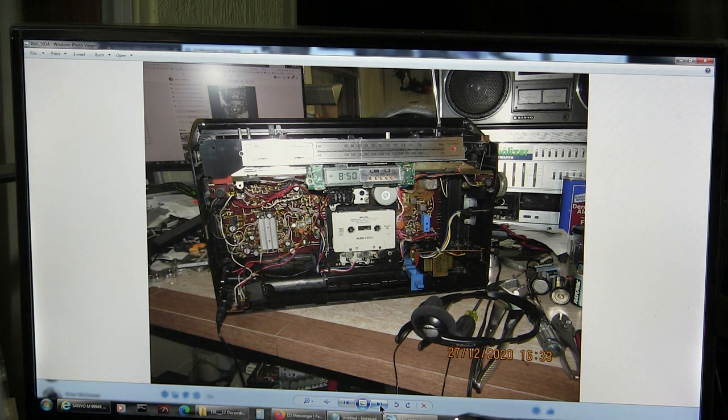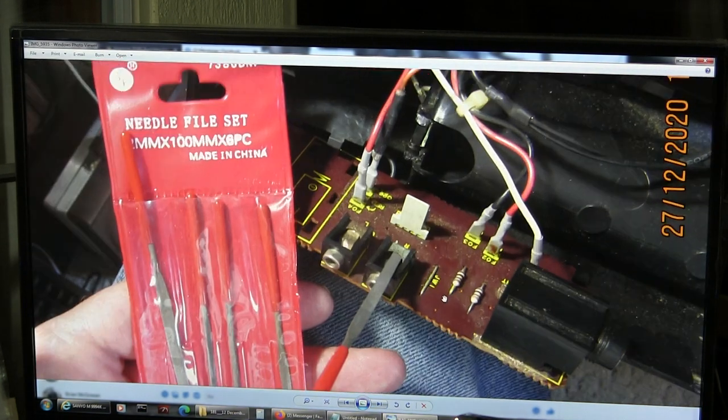Here I'm diagnosing the issue with the radio. I got the radio to play in stereo with headphones on, but missing one channel coming through the speakers. So I found the issue. The issue was the external speaker contacts were dirty in the external speaker contact. If you have sound through the headphones in stereo but not through the speakers, your sound goes from the input wires to the headphones and then from the headphones out to your speakers. If these switches don't work because they intercede the sound, then that switch was bad — no sound in one channel. That was the whole story.